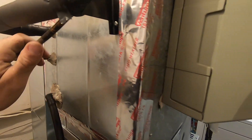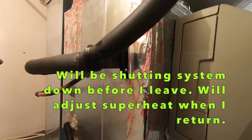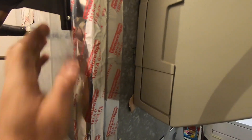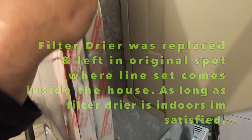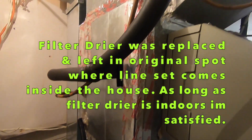I'm not going to check my superheat just yet. I just released whatever is lying in the condenser — the line sets are really short from here to outside. So I just left whatever is in the condenser, released it. I'll check my superheat when it gets warmer. That's it, quick install.